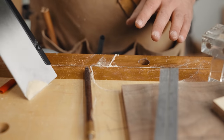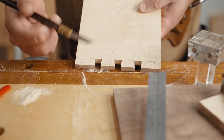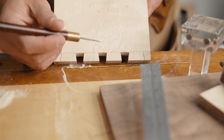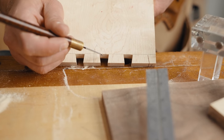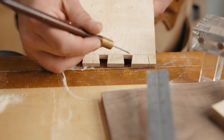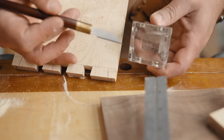Save your sawdust — it's a great filler during glue up to fix any mistakes, because we all know we're not perfect. With the coping saw, get as close to the line as you can. One little trick: always cut with your face facing the outside part of the board, because the inside matters a lot less. If you go too low on the backside, that's fine, as long as you stay above the line on the outside face.